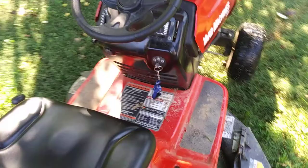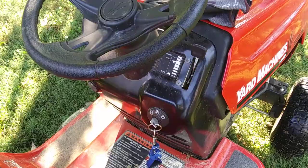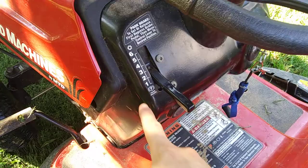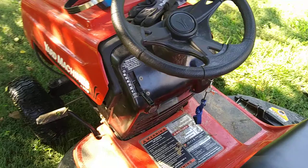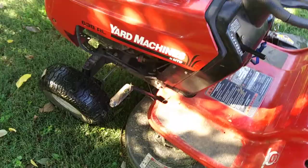There's a key for your ignition over here. You've got your choke and your throttle, and I will show you all of this in motion after I give you a rundown. Here are your speed controls — six speed settings. Normally I'm not going any higher than three. You really don't want to go too fast on this thing. You need to keep it at a slow speed; this machine can tip over pretty easily on a slope.